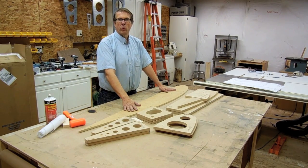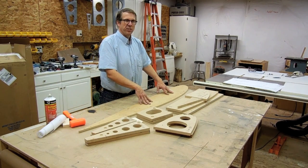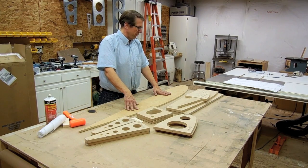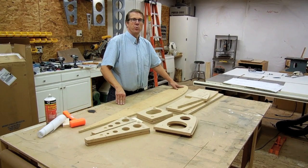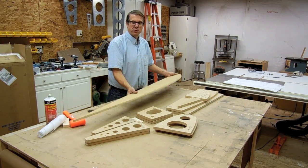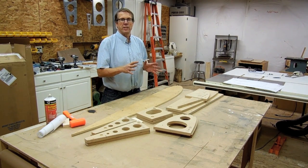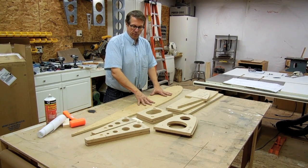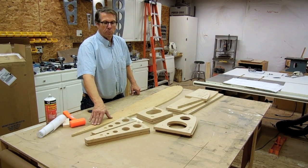Once I had this, I went through and, using a quarter-inch bit, I cut out all the jig pin holes that I would use and the reference holes for the center rib lightning holes. I left the other lightning holes for the aileron and the flap for later, but I also did cut out the nose rib masters. After I created this master form for the entire rib, I then went about setting up and creating the other masters for each of the individual ribs — a master for my nose rib, my center rib, the false rib, the flap rib, and the aileron ribs.